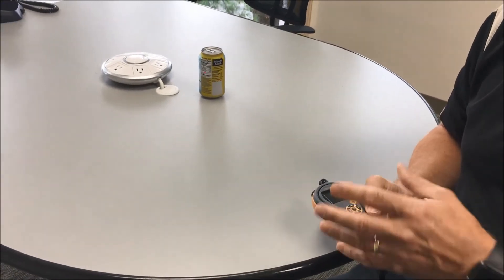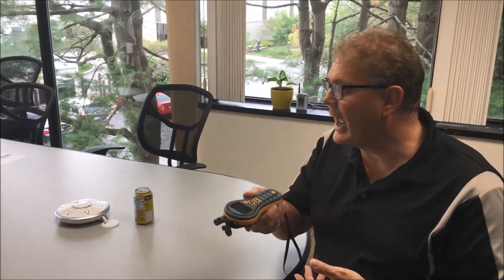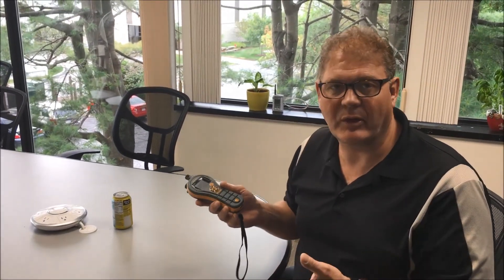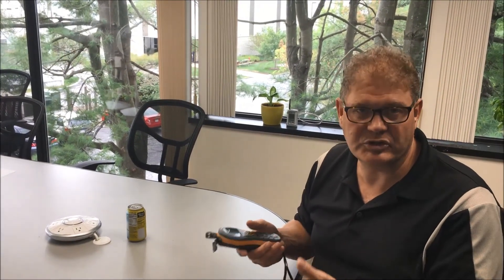In a practical application, you can actually stand in the room and point the meter at the wall surfaces, just wait for that audible sound, and then go and investigate with a moisture meter to see that condensation.